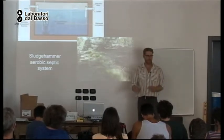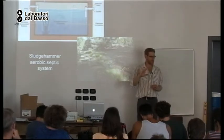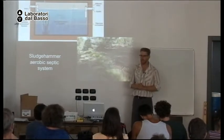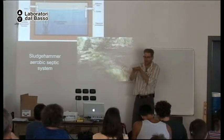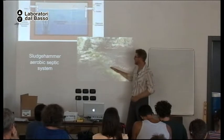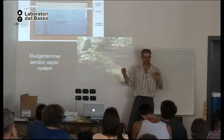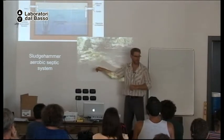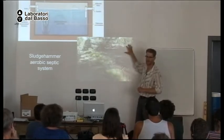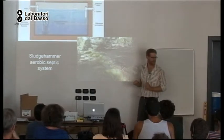that you can distribute the water coming out of the septic tank just 10 centimeters below the surface with a special drip irrigation line. And so you get the water higher in the soil with more life in it. And here on a sloped site, they planted native grasses, it could be other plants, right on top of the drip irrigation line on contour. So you get grass contour swales that help harvest the rainwater and the sediment coming down the slope. I like that. Okay.